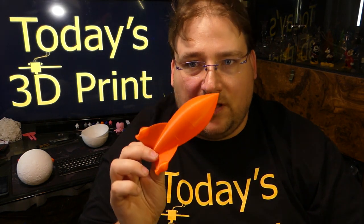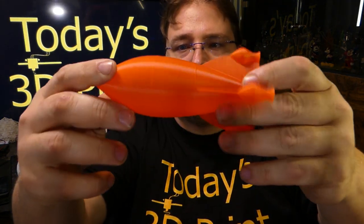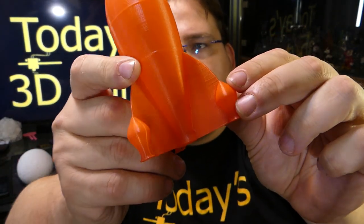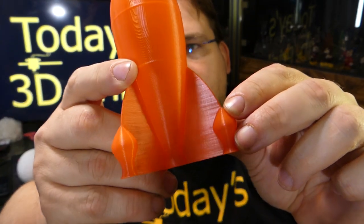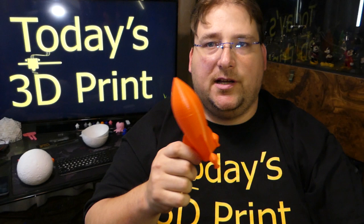As with most of my vase prints, once it's done the bottom layers I crank up the flow rate to 115 because I want thicker walls - and this came out great, super strong. The straight walls of the fins are very nice and flat, very low noise, good shape, cooled properly, no warping. I want to try printing a mega-sized one like I did on the CR10. I suspect I'll have the same kind of warping, since it's using virtually the same hot end and cooler as the CR10.